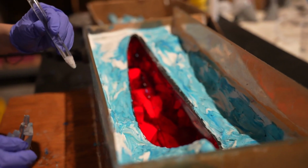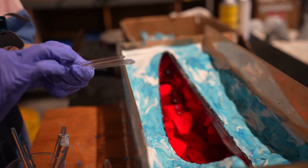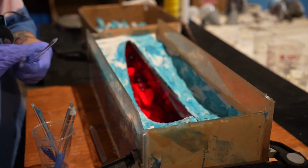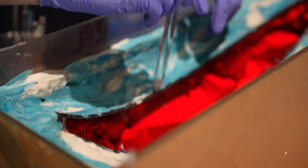And then for this one, we're probably gonna do like 4 or 5 air hole pockets. One here, one at the other end, 2 on the side and 1 right there. You don't want it caked on or it'll show in the silicone. So lowest part.